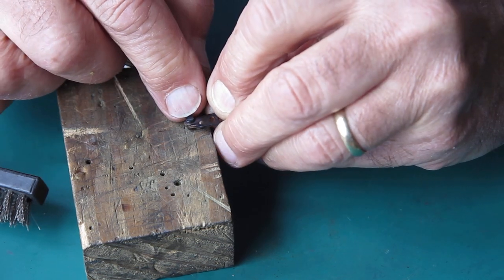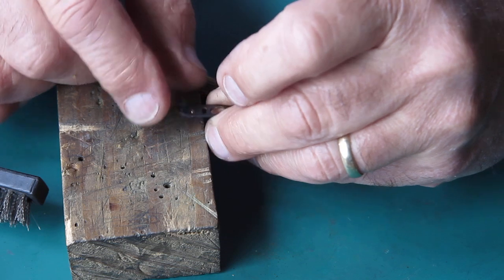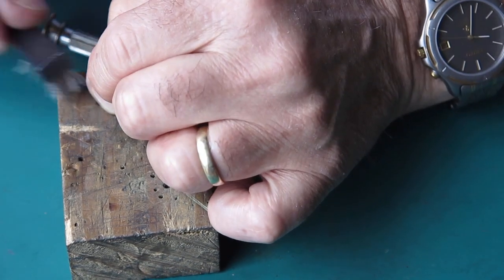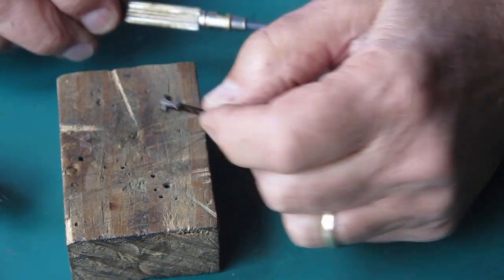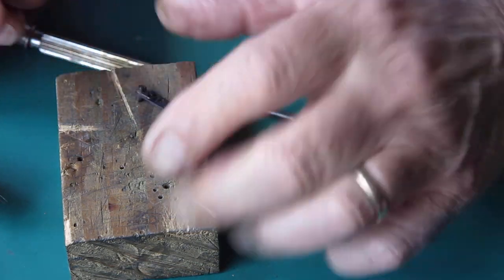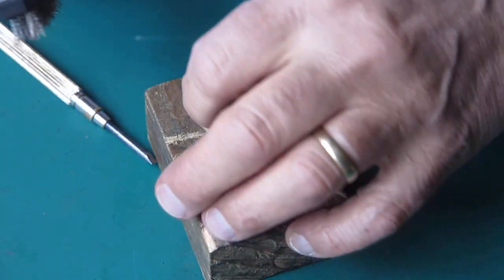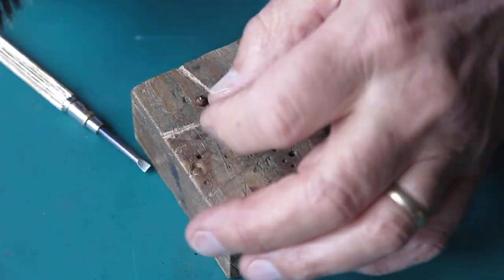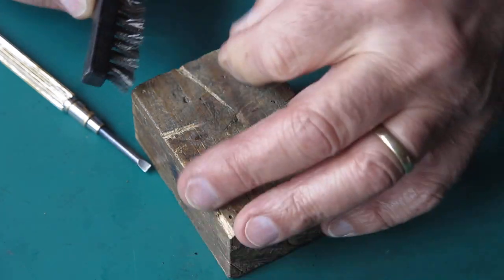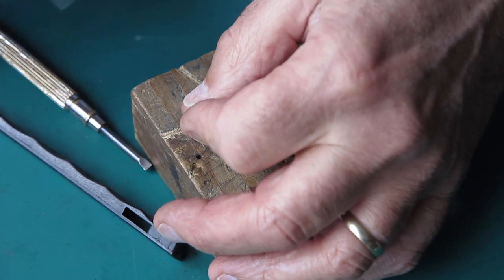It changes the angle of this plate as it contacts the post on the top of the camera that's pulled forward by the focus mechanism, and that effectively changes, I suppose you'd say, the effective acting length of this lever, and so it will move the rangefinder or swing the arm a greater distance or a lesser distance as you work through the range from one end of the focus scale to the other.